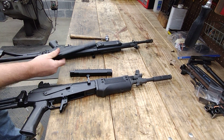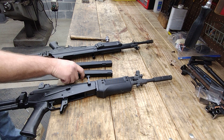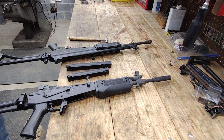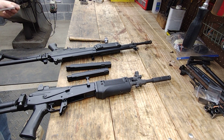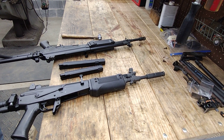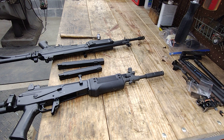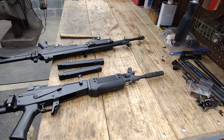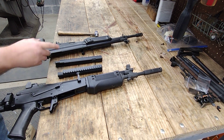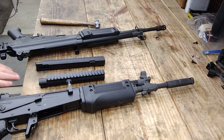I only did the ARM or AR length and the shorter SAR length. I got real picky on the specs — it's 6061 T6 billet bar stock. We cut them and sent them out for mil spec hard anodizing. Comparatively on weight, if I made a steel rail and put it on a standard gas tube, it's at least half the weight.